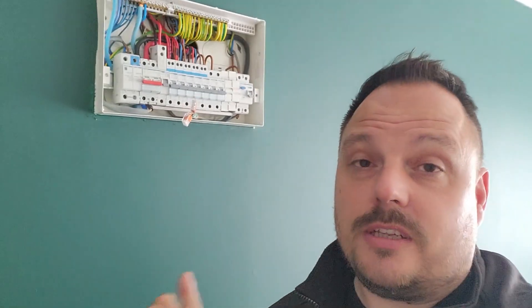It is just rock wool in the cavity so we didn't really need to provide any extra protection in terms of degradation from polystyrene that could come into contact with any outer insulation. It is worth considering dropping some conduit through between A and B to form a channel for the cable. People get upset about running cables in cavities but for electricians it's a very common thing. In this case we've run in a downward direction on the outside so any moisture that collects on the cable will run to the external skin. You can bridge the cavity and cause issues with damp, so as long as you seal the holes both ends nice and tight and have considered what is in the cavity, you'll be fine.